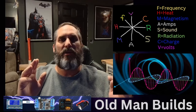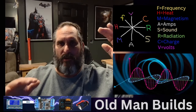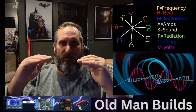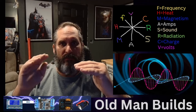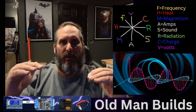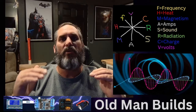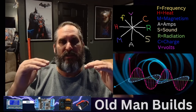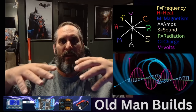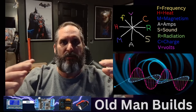As I bring the frequency up, it's going to bring the amount of amps down. You say 'but I have a set amount going in' — it won't matter, it's actually going to bring them down. When you see the actual voltage cross, there's going to be a part in there that's white — that's how many amps you have in your circuit. As you raise your frequency up, the amount of white goes away, the purple comes out better and thins out. By changing the frequency, you've now changed the amps, and I've also changed the amount of heat coming through that circuit. It also changed the ability of that spark itself to be airborne — it can put a charge in the air, where with more amps it keeps that charge close to the surface.